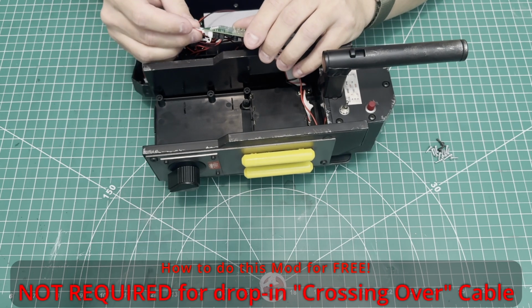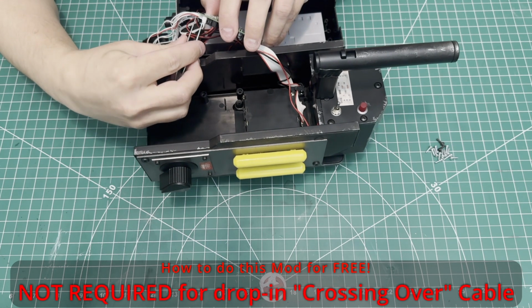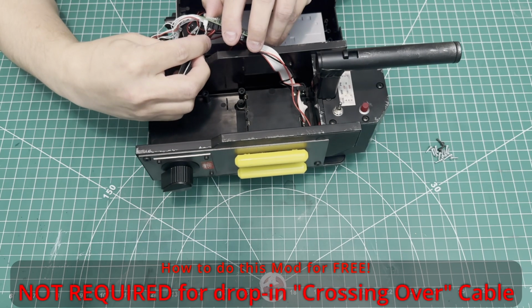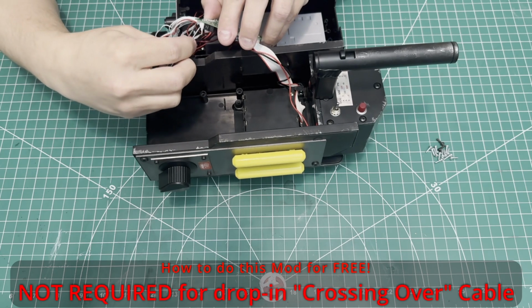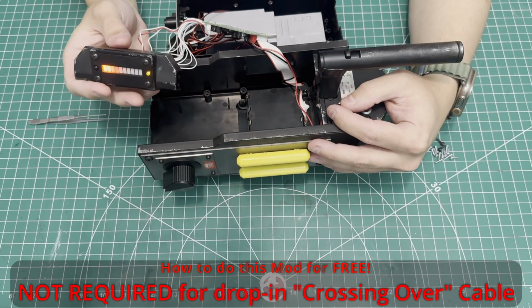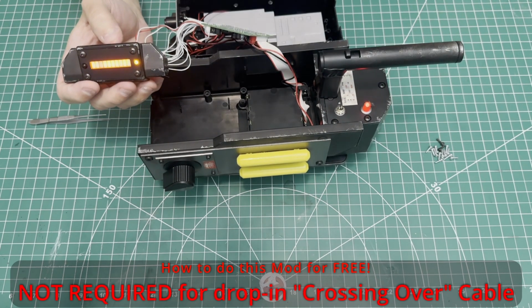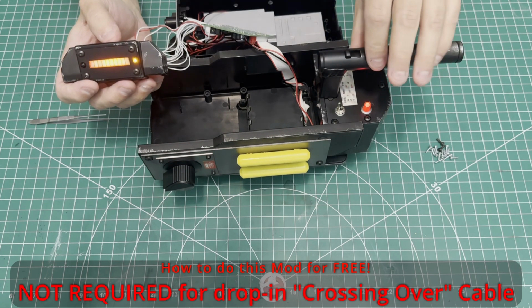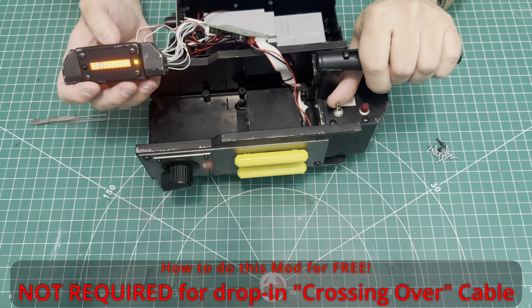And I recommend you do a bench test yourself, because you may forget to plug something in. If you do choose to do a bench test in this method like I'm doing, I have disconnected the set of thick wires with a black connector on them. That is the power for the door motors. That way I can have the trap cartridge sit face down on the table and not strain the wires, not break anything off, and I can test to make sure that I have the accurate, screen accurate lighting without having the doors try and open and pop the gear, and then necessitate having to look at my other video that I did. Check that out, where I show you how to open the gearbox up and make sure that your gears and the doors are installed properly so that they are timed in case your gears pop and skip on you.